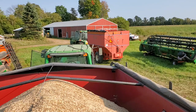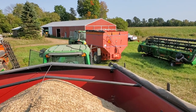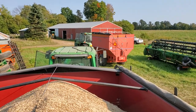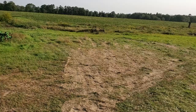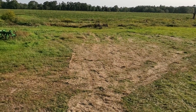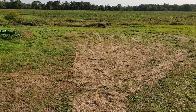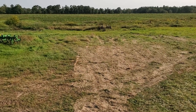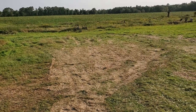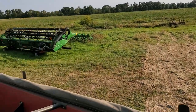The chaffer — the top one I closed down to about six or seven, and the bottom one is at one. The material that was blowing out the back yesterday — I looked at it closer and there really wasn't a whole lot of threshed grain in there. It was mostly pods that were cracked open, so I'm happy with that. I'll have to live with it.